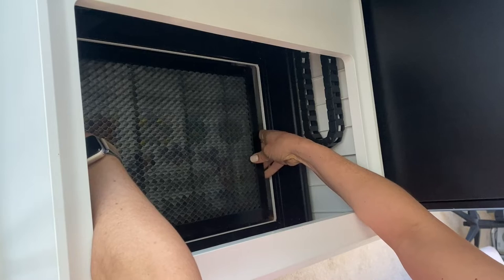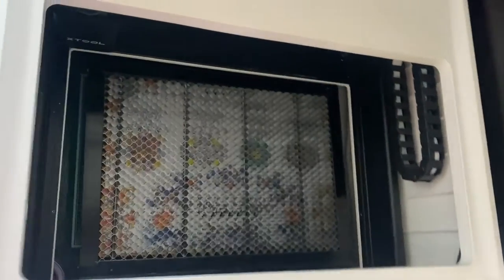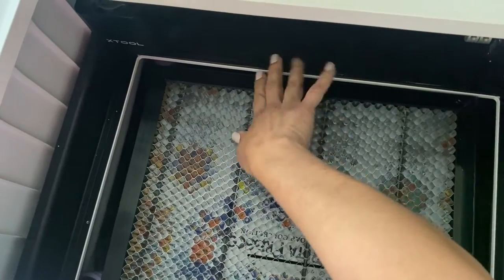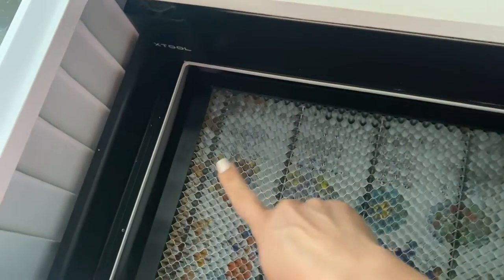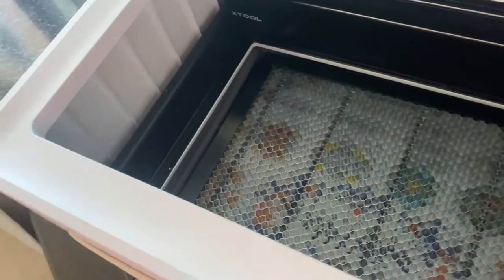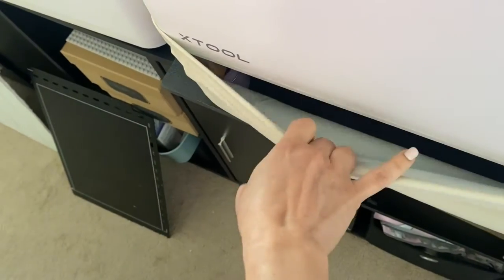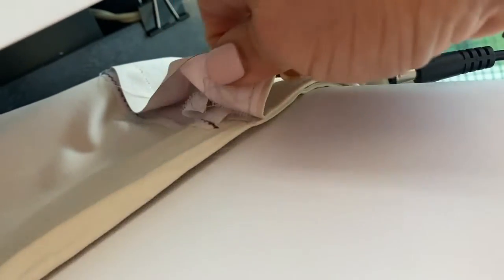This honeycomb is almost exactly the size of the bottom, but it's a little short on the sides — you can see there's a small gap. That's why I created a skirt for the machine. Since the bottom of the machine is open, materials or debris could escape. The skirt uses elastic and velcro and attaches to the bottom of the machine. It also helps with light containment so nobody can see the laser light when it's running, and it helps contain smoke, since the fabric is thick and has plastic on the bottom to keep smoke inside and directed out of the machine.